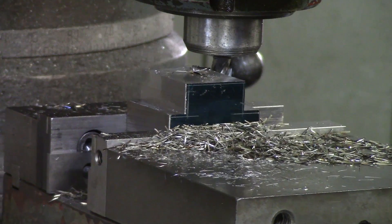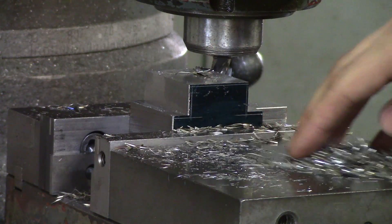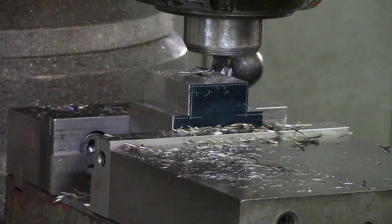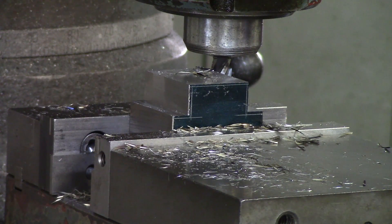We don't need to waste time showing you that — you're smart enough to know how to check things. If you do not know how to read a pair of depth mics, check out our video on how to read depth mics. That is how you rough on a manual mill. Same concept when it comes to radius cutters or any other cutters — make sure you are conventional cutting, not climb cutting, on a manual machine. On a CNC machine, climb cutting is actually preferred because CNCs are more rigid and can handle it, but on manual machines conventional cutting is the way to go.